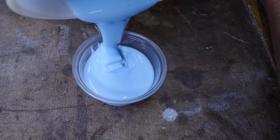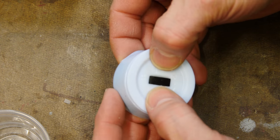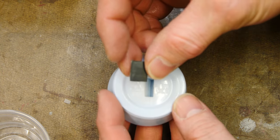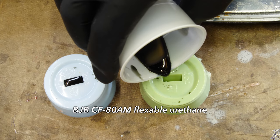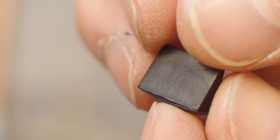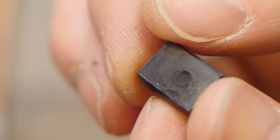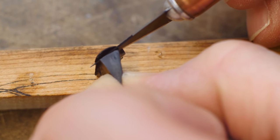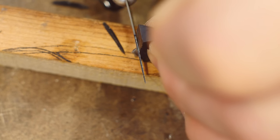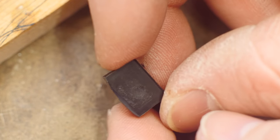I don't think I'll have any issues taking this part out — pop it out now that it's cured. I make two molds and we're going to use a flexible urethane to make these little parts. Tiny little parts — you can see the reproduction is very detailed. If you have a little bit of excess you need to trim it off with an X-Acto. That is the downfall of an open face mold: you get one nasty side if you pour in a little bit too much.